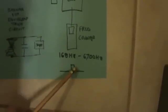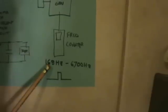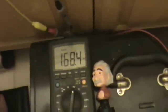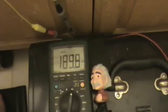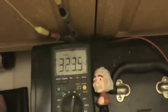This pulse generator is putting out a pulse near it, and we can look at the waveforms. The pulse is a square wave; the pulse width is fixed, but with a potentiometer I can adjust the frequency from 168 Hz all the way up to 6.7 kHz. Here's the frequency generator at the bottom of its range — I'll dial it up and you'll see it goes up to around 6,500 Hz.